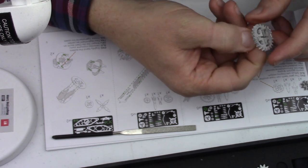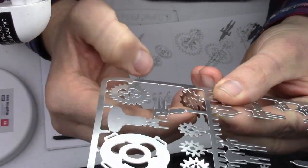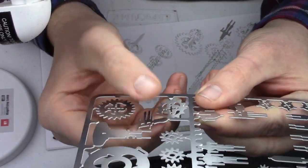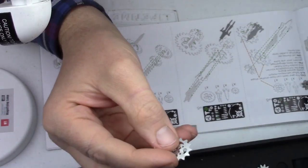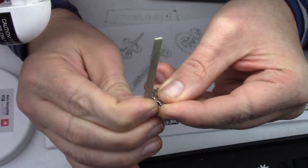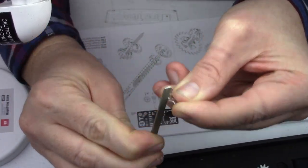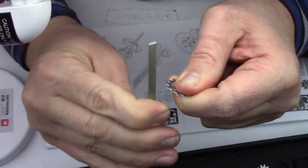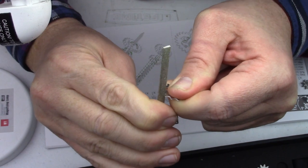The large gear did not seem to properly fit the part. I then realized that I had the wrong gear. I should have pulled one of the sheets of metal and not used one of the thicker gears. It was suggested to me to be sure to file the gears down smooth so that they mesh smoothly. I think this is a very good idea.